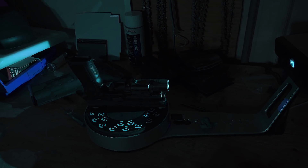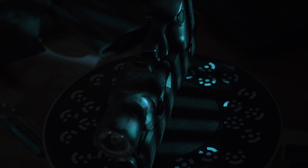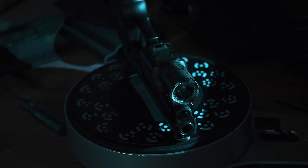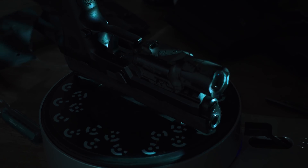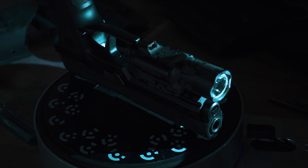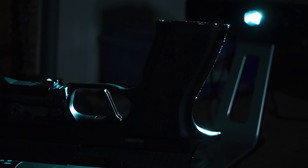Now there's a bunch of different ways to do 3D scanning. The most common is photogrammetry, where you take a whole bunch of pictures of an object at different angles, and the software magically figures out what 3D object is being represented in all those pictures. Then there's laser scanning and structured light scanning, which is what this is. The projector is projecting a pattern of light — a grid — onto the object, and then the two cameras on either side of the projector can see the way that grid is distorted by the surface and can figure out what exactly the contours of that surface should be.